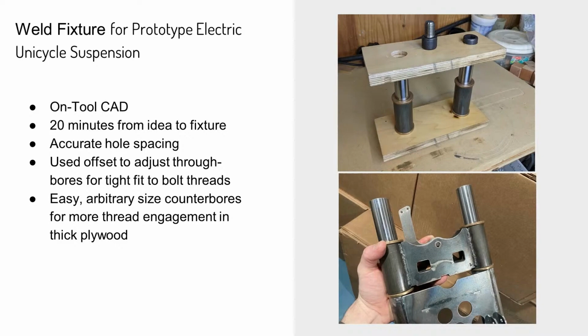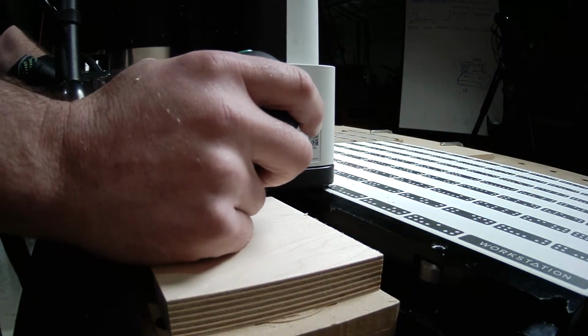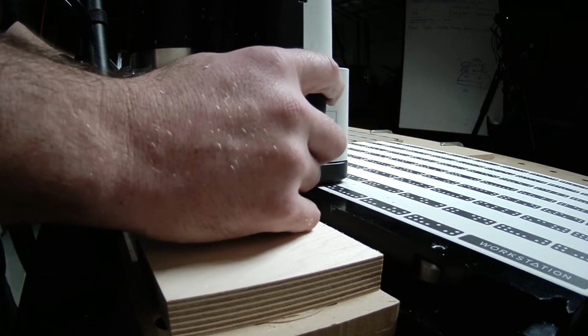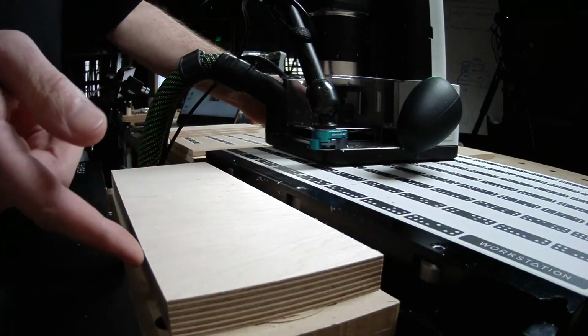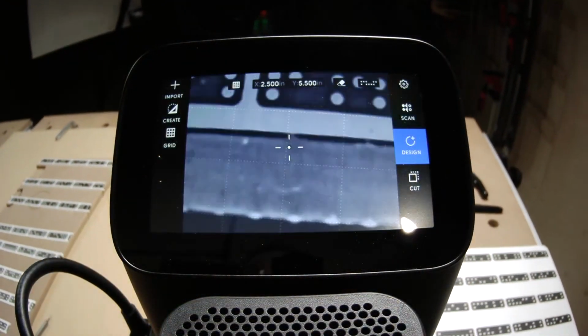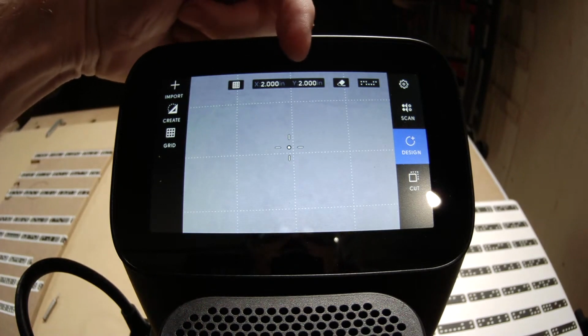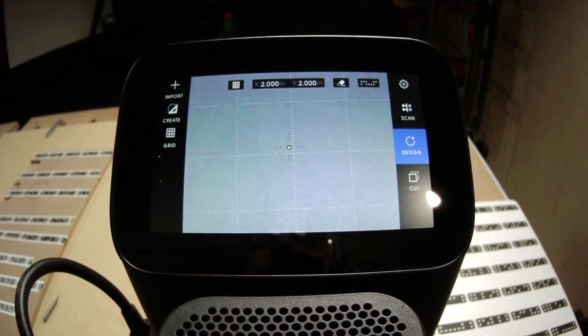Well, we've got some wood set up here. It's funny. We were describing this and how simple it is, which on one hand is very interesting to show people. On the other hand, the simplicity is the beauty of it. The fact that we can cut this. So you'll see down here, we got just a similar piece of wood as Dylan had there, 3/4 of an inch thick. I've swapped now to the stock 1/4 inch cutter. And we can look at my screen there now, nice. And I can now lay out basically mimicking what Dylan was doing there. So you'll see I'm just moving to a point on the grid that's 2 inches up from the bottom left.